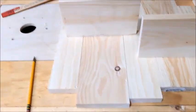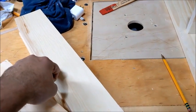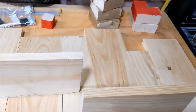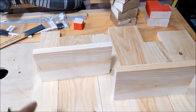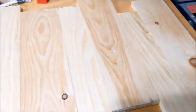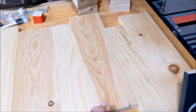To get started, what you're going to need is one 1x6 six-footer and one 1x4 six-footer. So we're going to cut them all at 18 inches. I haven't glued these in - as you can see they're just kind of randomly placed. I'm going to kind of play around to see what I like here. So we're going to use three of the 1x4s and three of the 1x6s, 18 inches each.